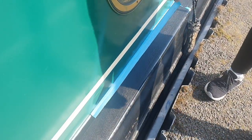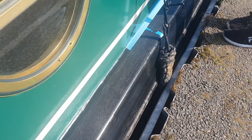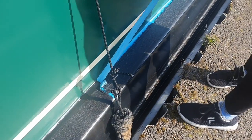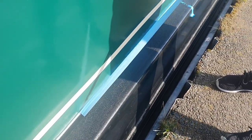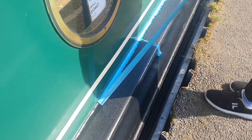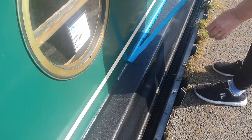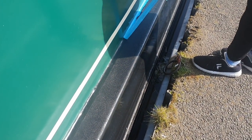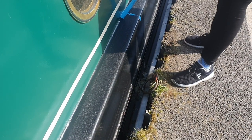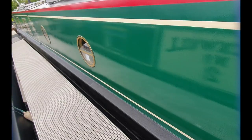Keep it at an acute angle taking the masking tape off. We left a little bit of a gap between the side of the cabin and the gunnel — water gathers there — and the bits that lead out to the edge of the gunnel, just to give water a chance to drain. The T-Mac shore grip worked really well for us — stippling it on works well. Look at it — looking good, really proud of our work.